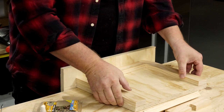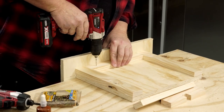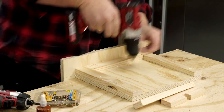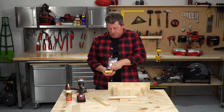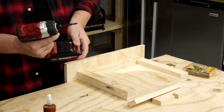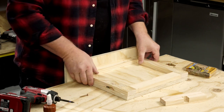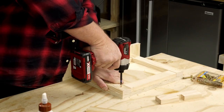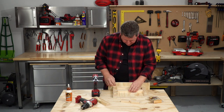And then our bottom piece — just while the glue is wet, you can maneuver it a little bit. Grab your drill and get a couple of pilot holes done. At this stage we're going to screw it down. We'll need to square it off with our other pieces. I'm using 35mm screws this time, 8 gauge. Get our next piece of 250mm just at the top there, just to make sure we're not going to squish everything in too tight. Leave a little bit of room between these so that it's not super tight. Double check everything all the way down to make sure it's not going to be too tight.